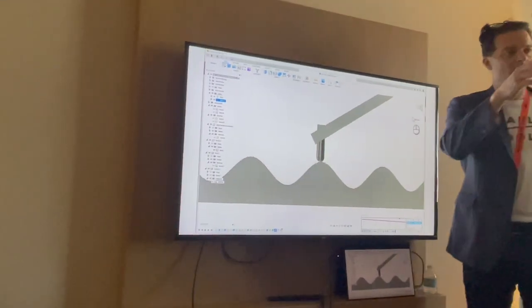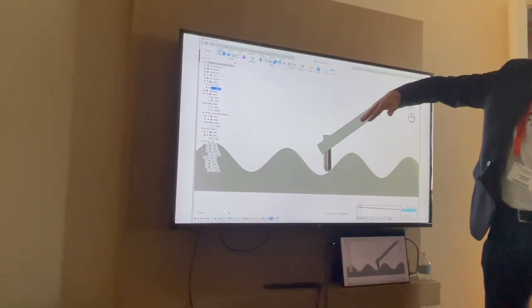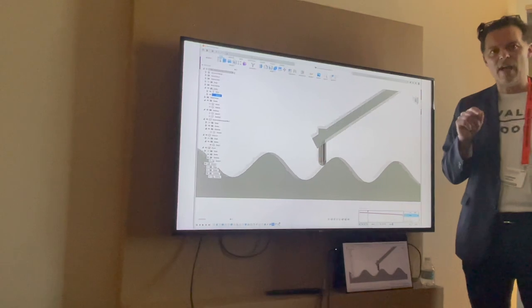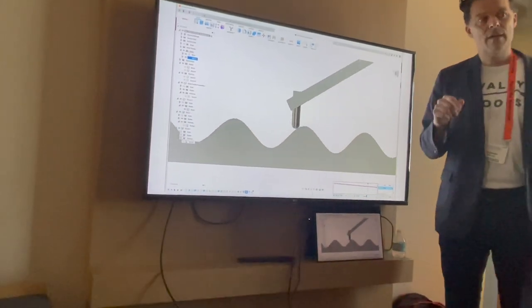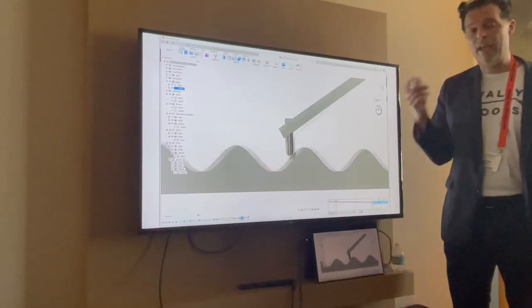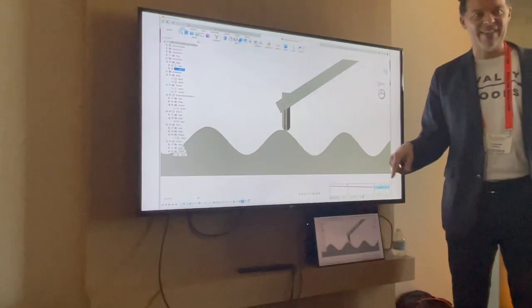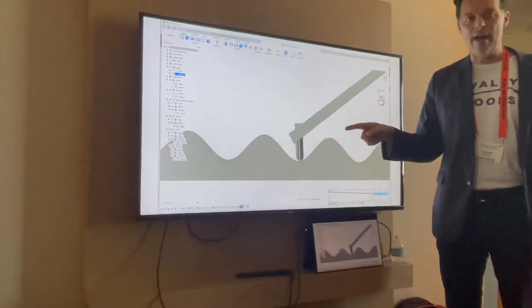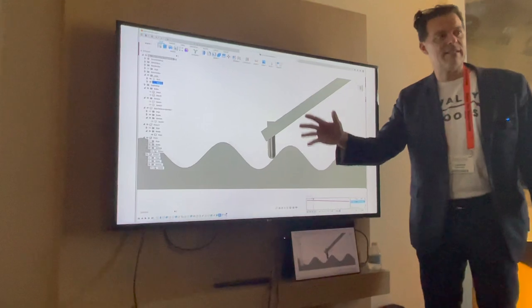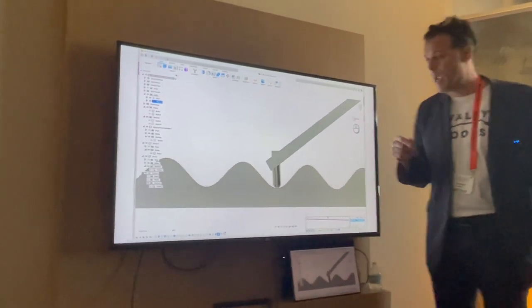So this is a representation of a vertically modulated groove. Again, remember, not too much of this in the stereo signal, but it's there, right? And if you notice, and this VTA is pretty steep, notice what's happening with the velocity of this stylus as it transits up the undulation and then down the undulation. The velocity is very different. It's slow going up, it's fast coming down. Now, cartridges are velocity-sensitive instruments. The higher the velocity, the louder the amplitude, all right? So this would make for an interesting waveform. If the VTA angle was less, you wouldn't have that happen. You bring this down and the velocity evens out. Okay. That is absolutely correct, yes. So this is the cost, and the result of this electrically are forms of distortion, intermodulation, and harmonic. Again, this is the least sensitive to being wrong, audibly, for us. Principally because there's not as much vertical content in the groove, all right?